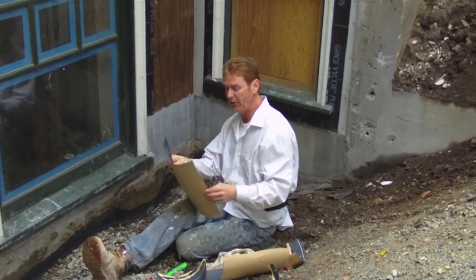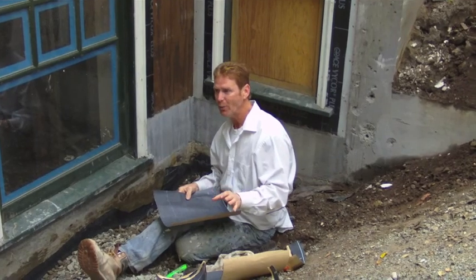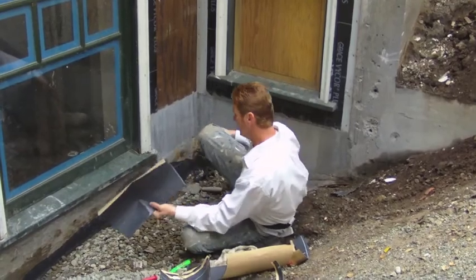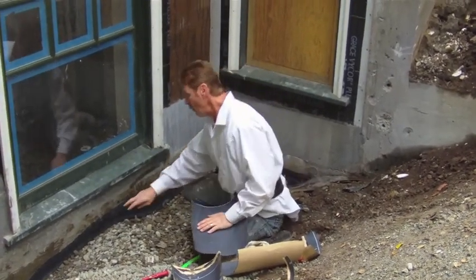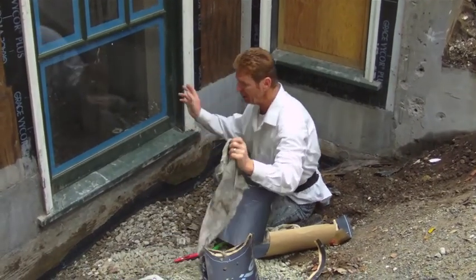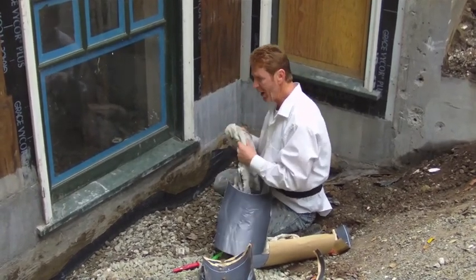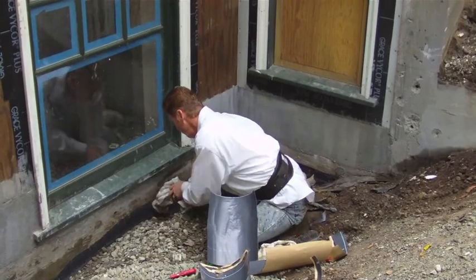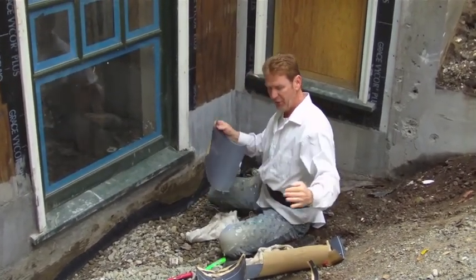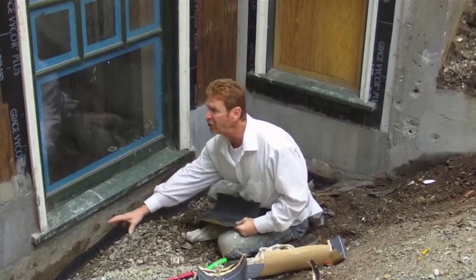If you're going to use this membrane, it's best to use it around nine o'clock in the morning. If you use it in a hot sun, it sticks to itself — it's a real nightmare. I've used about 50 boxes of this so I know how to handle it. What we've done with the existing membrane is take wire brushes, score it, hit it with wet rags and cleaned it, then dried it off. It's got to be really, really clean — as clean as you can get it. If you use big sheets, it's harder to work with.